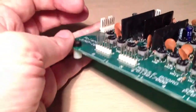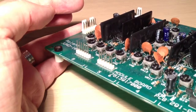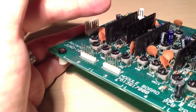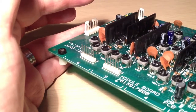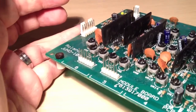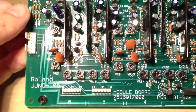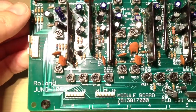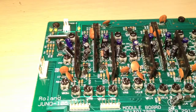You can see that the original chips are sitting a lot lower on the board than the replacements, which are standing as if the legs have been lowered into pits of solder. So possibly when they were replacing that, they were using desolder braid and couldn't get the holes to clear. Not surprising — I absolutely detest desolder braid.